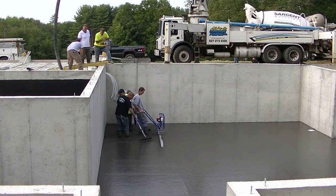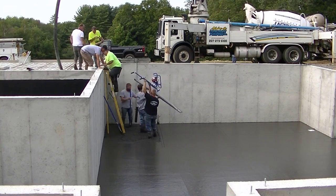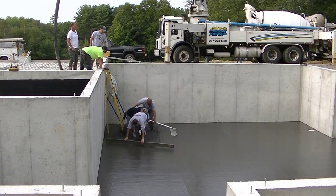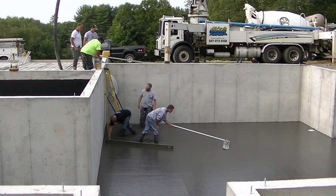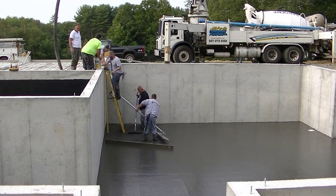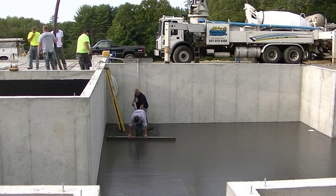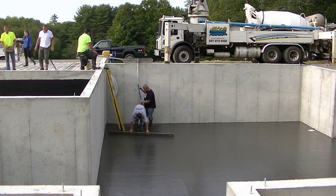Stay tuned — coming up right at the end, I'm going to show you where to buy this color, how to buy it, and how to save some money and get it shipped free right to your house. We're done with the Vibra Screed. I'm not going to use it in the garage because the garage has a center drain — it's got a trench drain — and whenever something has a drain where the whole floor pitches to it, we always like to screed it by hand to make sure it's perfectly pitched. If you guys like this stuff and this video is giving you value, go ahead and hit the like button. If you're not subscribed, go ahead and hit subscribe too — I put out a couple videos a week showing you how to do concrete, whether it's floors, slabs, pool decks, sidewalks, patios, stamped concrete, or concrete repair.